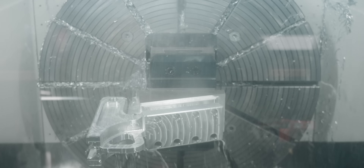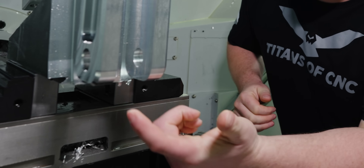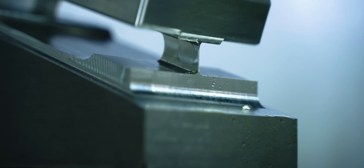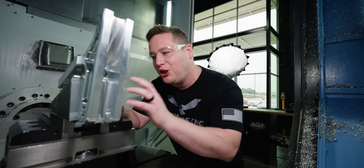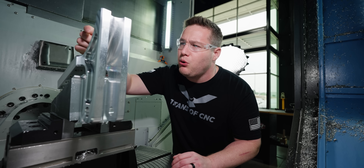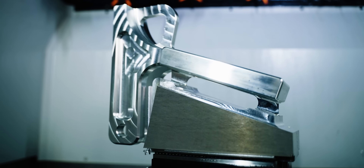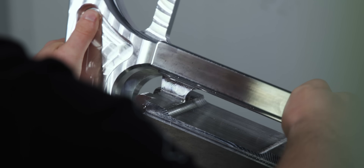Op 1 is complete — and here's my favorite part about a 5-axis machine: that wiggle wobble. I don't care if you've seen it a thousand times, it never gets old. I love tabbing parts just to see this. The biggest kicker is we've got a huge amount of material that we don't have to rough on the second side, saving a ton of time. So what we're going to do now is snap this part off, build a fixture for our second Op, and get this part complete.